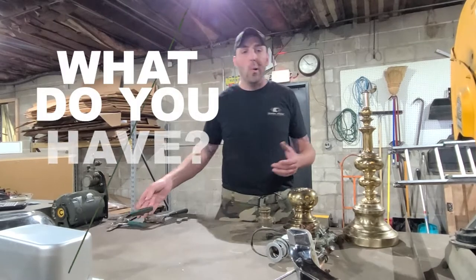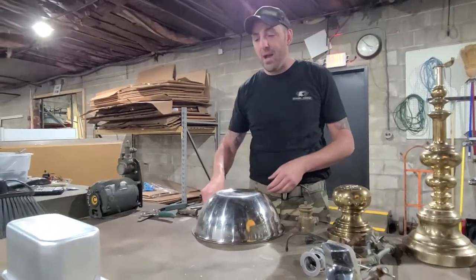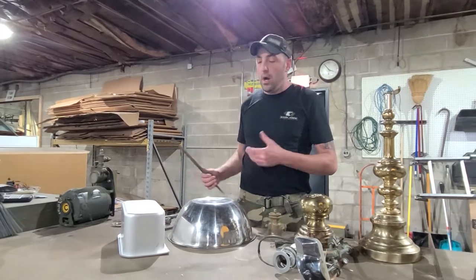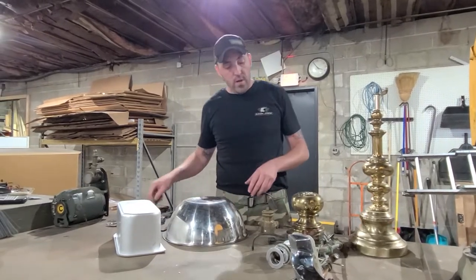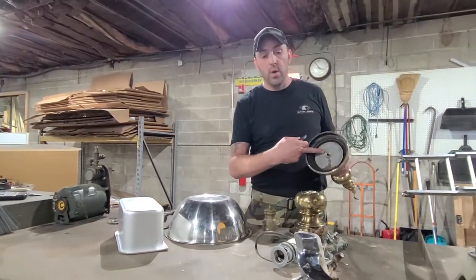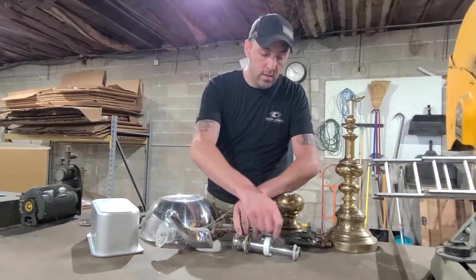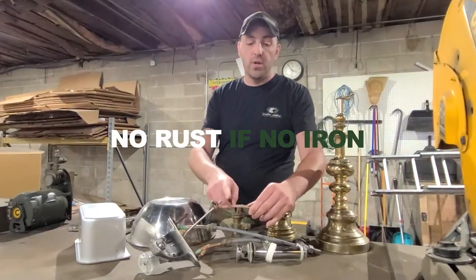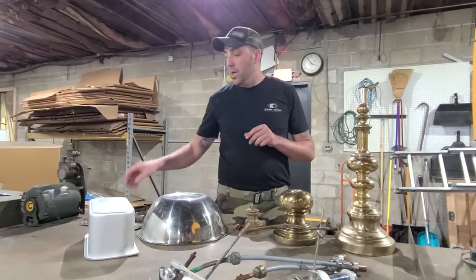Next thing — how do you tell what you have? We talked about these basic tools and I'm going to use them. First and foremost, check your magnet. We're going to start with two things that are silver in color. I put on my magnet — it doesn't stick, so we know it's not sheet iron, tin, or iron. It doesn't have any iron properties. If it's rusting, it can't rust if it doesn't have iron, so it's probably going to stick to a magnet. So now we know it's all non-ferrous. Next thing: what color is it underneath? Take a file to it — see what color it is inside.